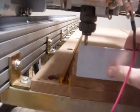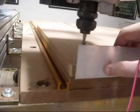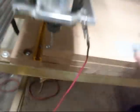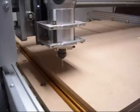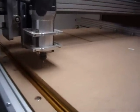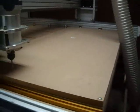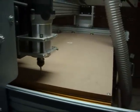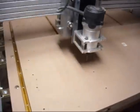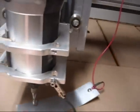This is just setting the corner, and I've got to speed this up — this is instead of using Ernie's edge finder. It works in the same way. And now I've got my Z plate set up, we're going to zero this now.